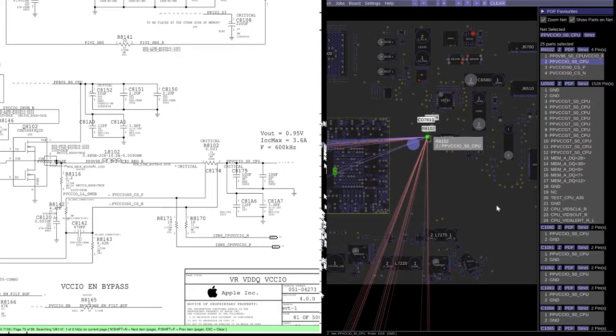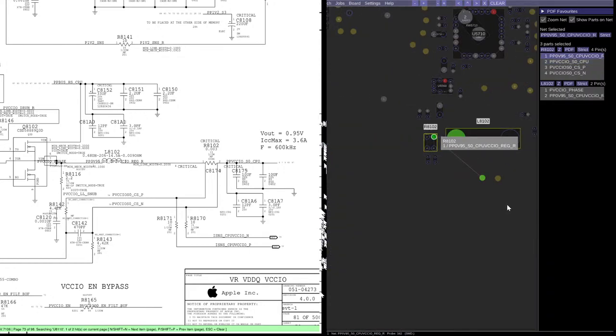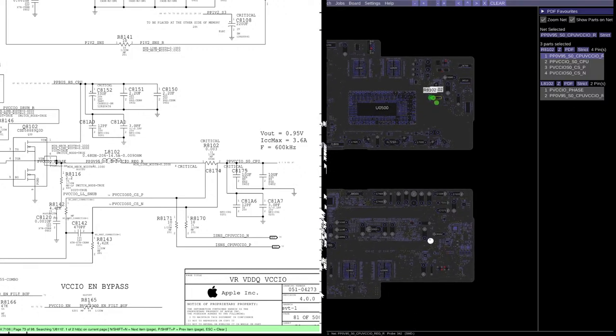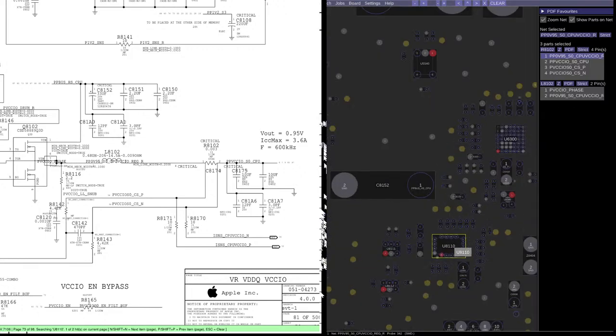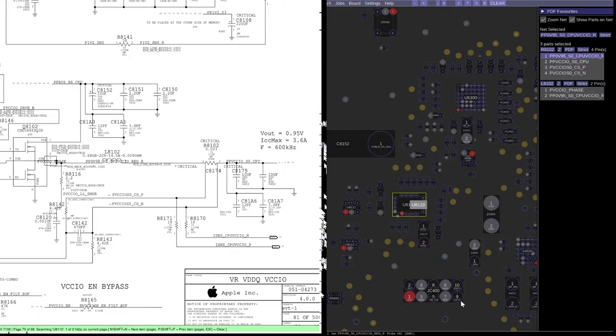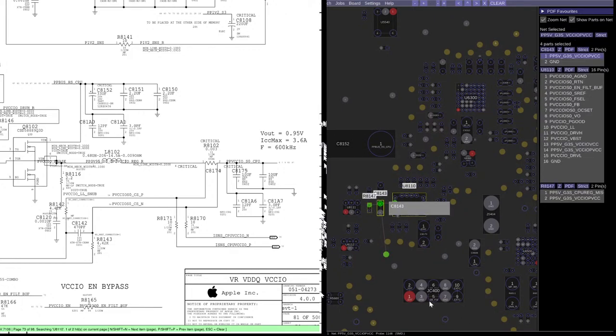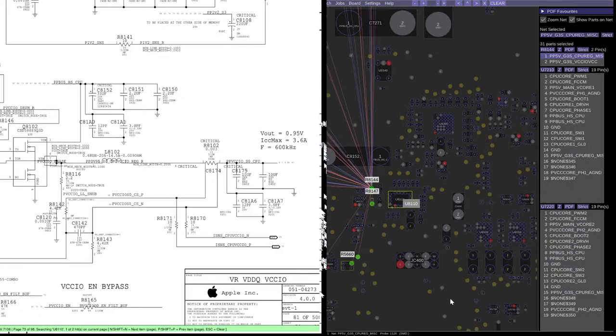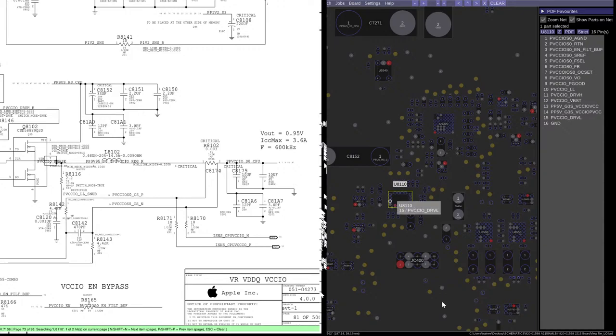That's what the VCC I.O. is. So this is power, the VCC power for the CPU for its I.O. ports, probably internal USB or something like that. Not sure about CPU architecture that well. But that's where it's going to. That's what this is all controlling. But there's nothing wrong with the output. The outputs seem fine. When you test all the outputs, everything seems fine with the CPU. It's the inputs here. That's coming from the 5 volts that goes everywhere, the 5 volts miscellaneous. This is shorted. So let's take a look at this on the board.